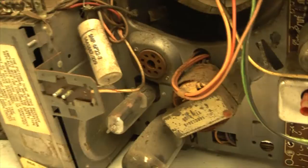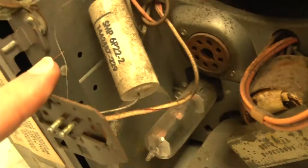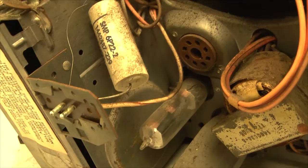I was trying to look behind the chassis for a fuse or anything, and I found a major problem right up front where I should have started. The power comes in, and nothing's connected to this terminal. This little whisker here was actually connected to a cross there - I broke it just messing with it. Something is seriously wrong right here - there's no fuse, there must have been a fuse up here. This is supposed to get a chassis ground, but this whisker wire is also connected to chassis ground. Something is seriously wrong here and I'm going to have to get the service manual and find out what belongs there or how that's supposed to be wired.